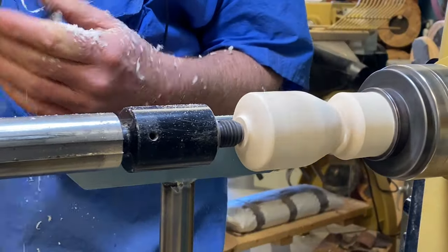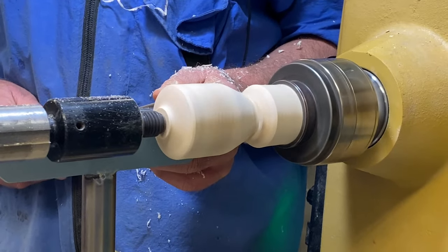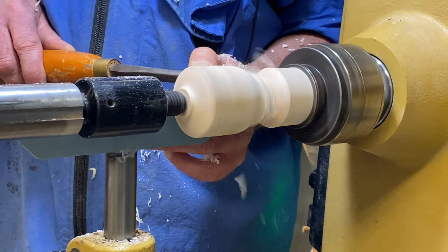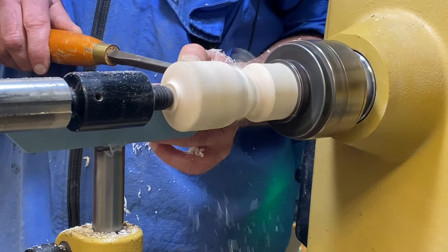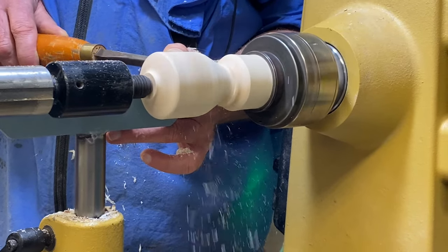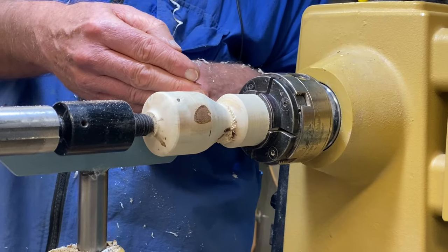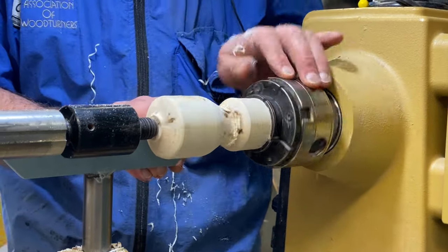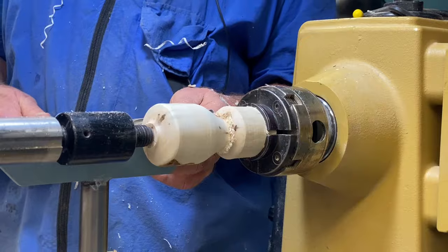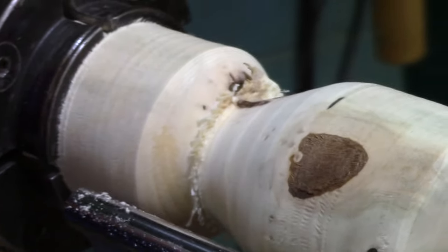This is where Claude might be able to help me out a little bit. I know it's more of a scientific question that I just haven't looked up the answer to. When I go from center here and do a left-handed cut, there's a tendency for it to hop. I'm getting off the bevel a little more on the nose. You can kind of hear it. Oh, there we go, hear that? It hops. We know the cell's grain goes this way, so I'm shearing off the end, but I'm still getting this hop. You can see the wavy action right here with that beginning of the hop. However, when you go from center to right, it doesn't tend to happen. So, just an idea. Not sure. We might have to ask John that one.